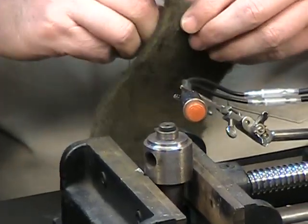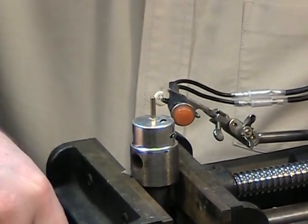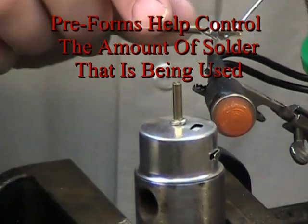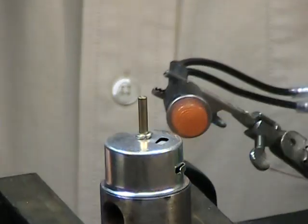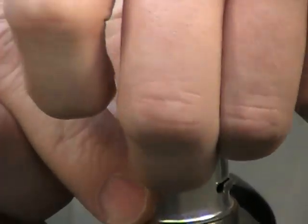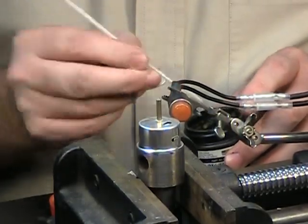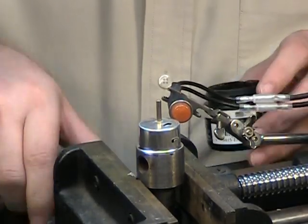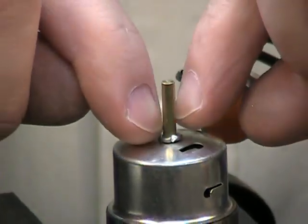Now, I'm going to use the same handpiece — same power unit, same handpiece, the 105-127 — but I'm going to use a preform. I took some solder and wound it around these little brass mandrills. You just wind the solder around the piece you're going to use so it's the right size, then slide it off and clip them apart. Now you've got your own ready-made preforms. I'm going to add just a little bit of flux right in the joint, because even though there's flux inside the rosin core solder wire, I want flux in the joint to help draw the solder where I want it.